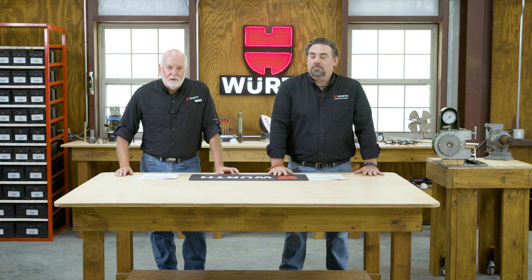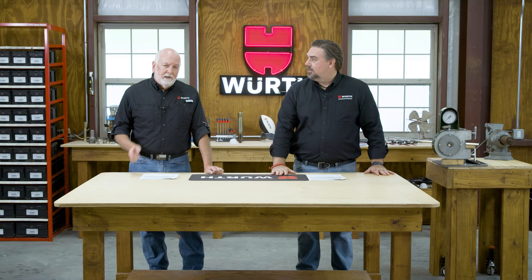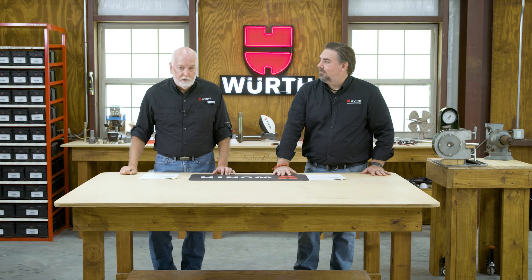In conclusion: bolts act like coiled springs. You need to account for your force load, your joint connection types, and hole dimensions — all absolutely critical. Torque is primarily a rotational force to overcome friction. Due to potential changes in friction, wrench calibration must be done on the job site at the beginning of each shift. Types of joint design and how bolts work — that's worth knowing. Thanks again to Chris Tribble. Make sure you subscribe so you're notified of all future episodes.